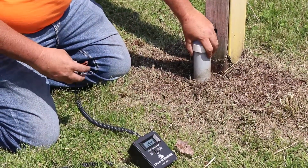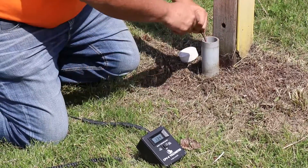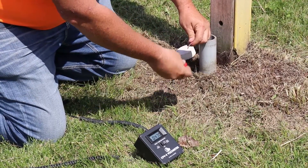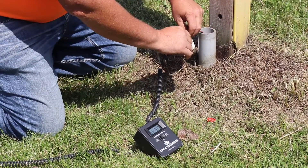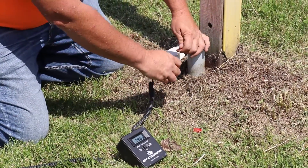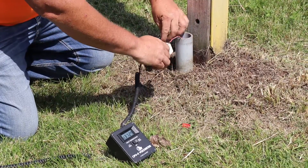Cathodic was an issue with our steel pipe of course. We've got multiple test points — some curbside, some at houses. Our curb ones are currently a piece of PVC with a cap on it, with two wires coming up and wing-nutted together. So right now we have to take the wing nut apart and figure out which wire is which if they're not marked, then check the cathodic across to make sure the anode is good.